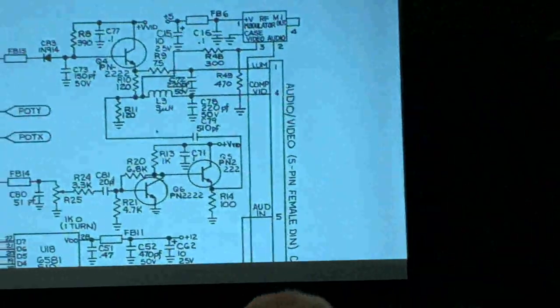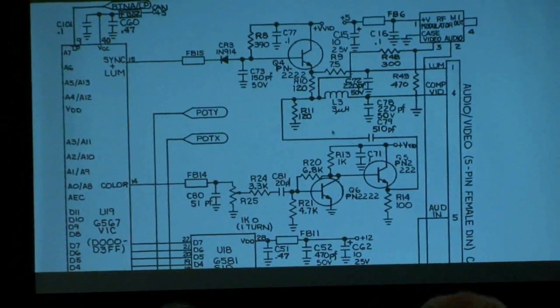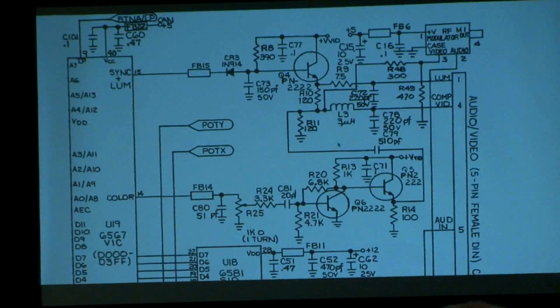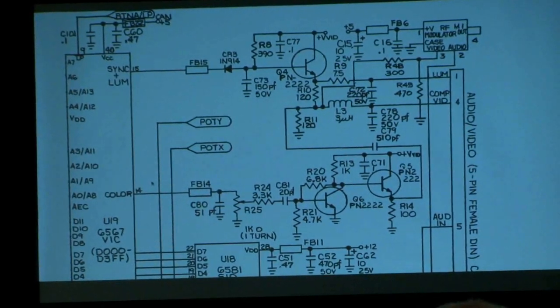If it's on this side of the pad, it's an addition. Yeah, right. So here's the color circuitry on the outside. God, I never get tired of looking at this. And this is before the modulator was heavily customized for us. That's right. So you've got just the brightness coming out, along with the sync signals and then the two-phase color.